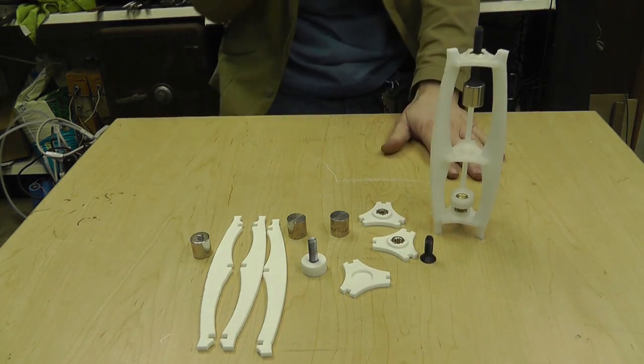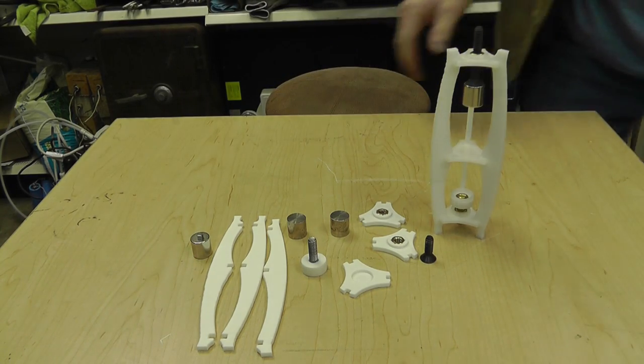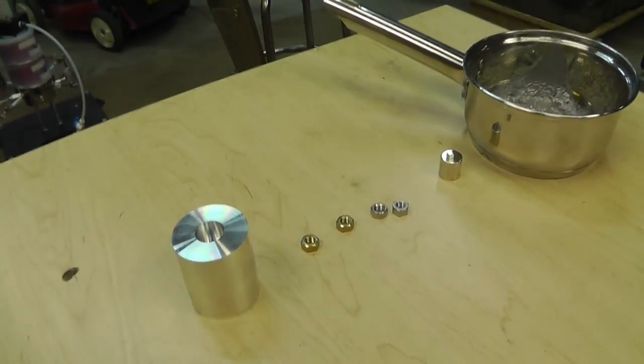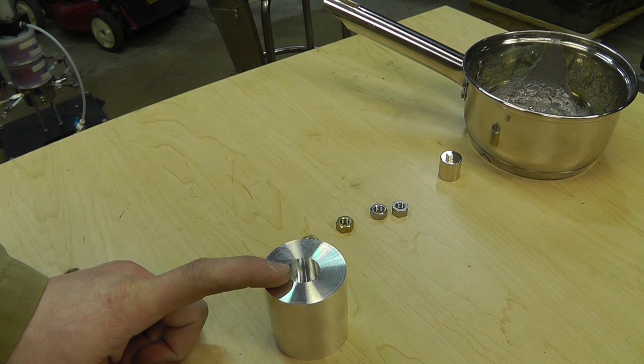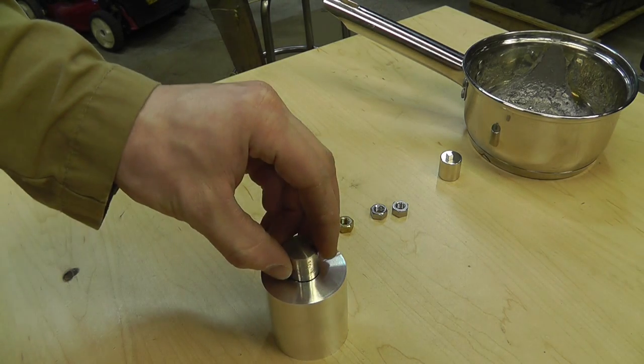There is the levitator kit. I will be making a video of how to build this all by yourself. As a quick reference: you're going to need a mold — this is a half inch by three-quarter inch by three-quarter inch depth — basically that's to mold the bismuth.